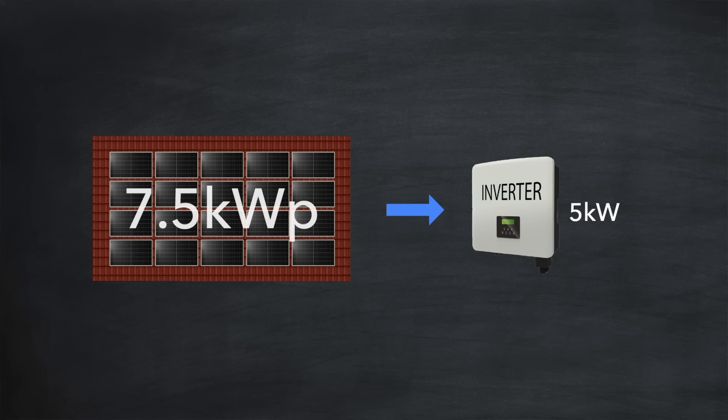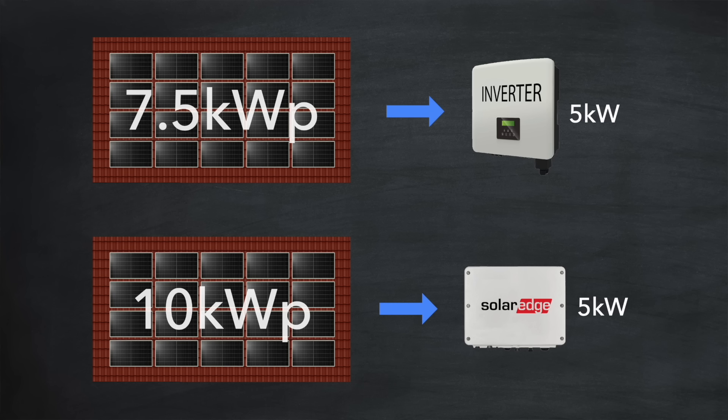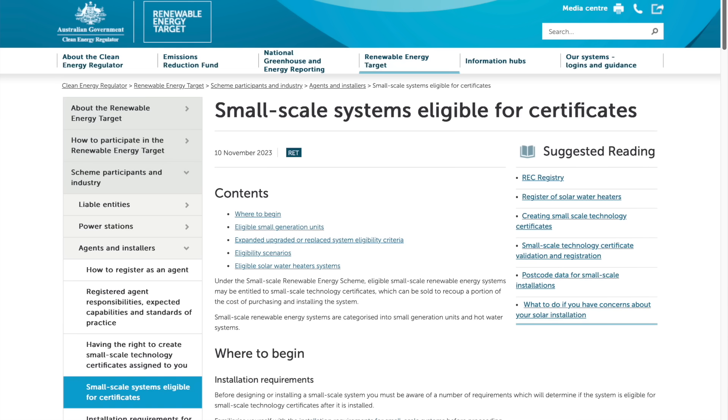So by how much can you oversize your solar array? It depends on the manufacturer of the inverter you've chosen. Most inverters allow oversizing of 150%, meaning your solar array can be up to 150% of the size of the inverter — for example, a 5 kilowatt inverter can support up to a 7.5 kilowatt peak array. But SolarEdge inverters typically allow up to 200% oversizing, so a SolarEdge inverter of the same size can support an array up to 10 kilowatts peak. It's worth checking for any country-specific legislation or prerequisites if you're receiving any government subsidy, as there may be oversizing restrictions — Australia has such restrictions for their small technology certificate subsidy, for example.